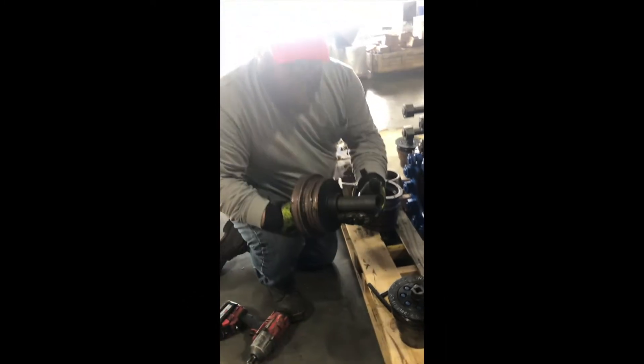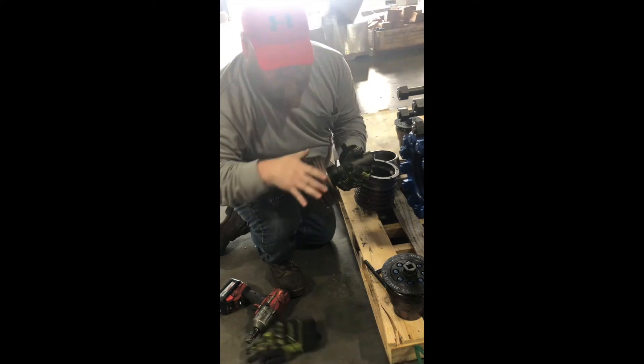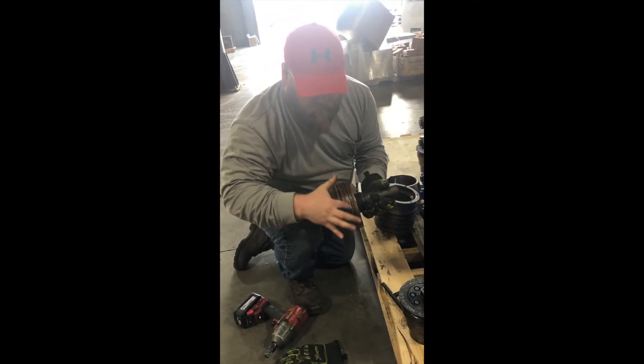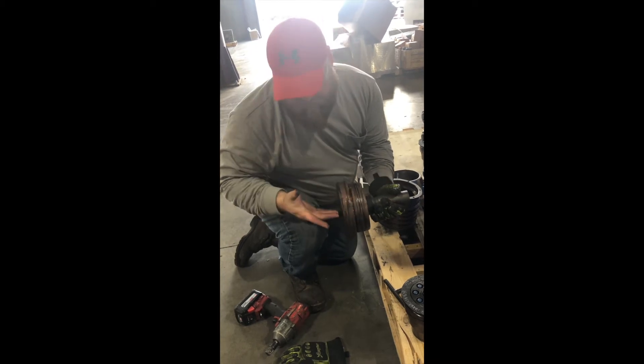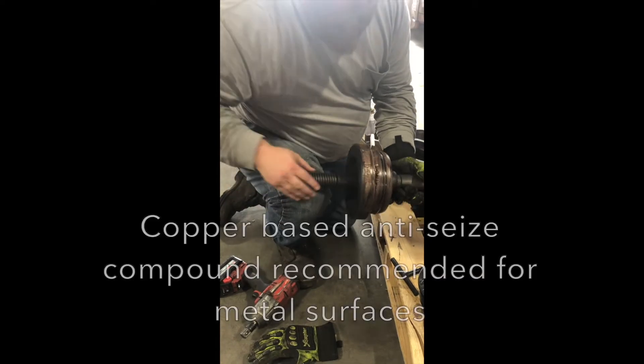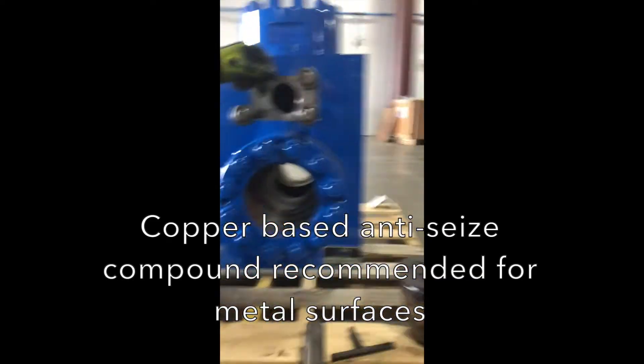Always clean, inspect, and grease components before reinstalling. Check for any washing developing above or below the seal surfaces. Make sure to check the top of the plug where the segment assembly rides, and also check the threaded stem for any cracking or if that nut may be backing off. Inspection of the seal surface area inside the module is always a great idea as well.